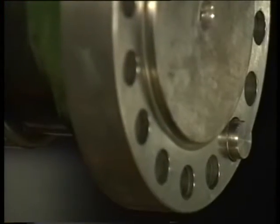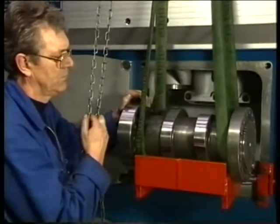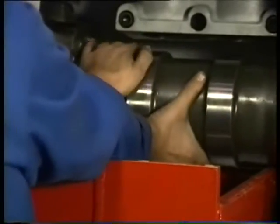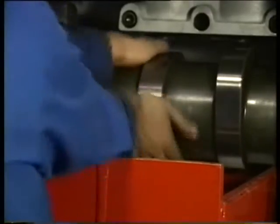The frozen-in dowel pin is, in every camshaft section, located in the same position. The dowel pinhole in the journal determines the right position of the camshaft section. Watch out for damage to the centring rim and the dowel pin while rolling in. Then, turn the shaft in the correct position so that the dowel pin can be fixed in the pinhole of the journal.